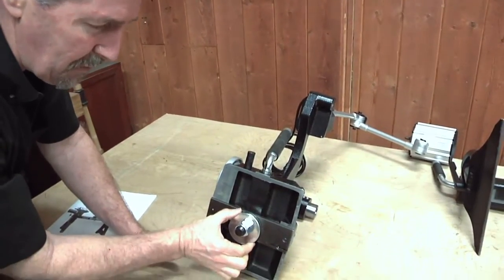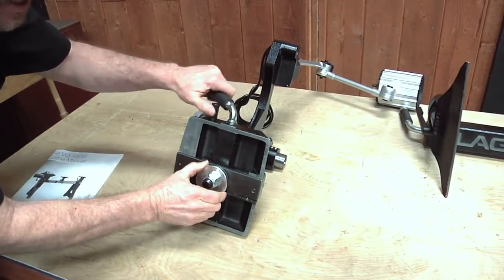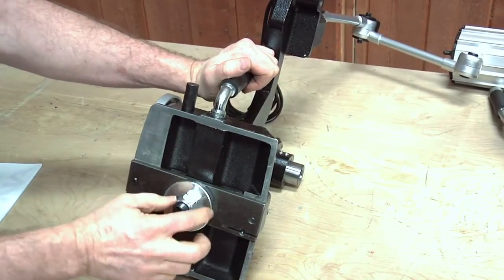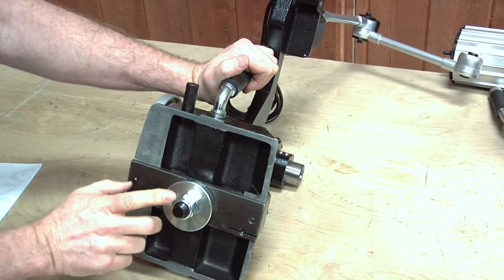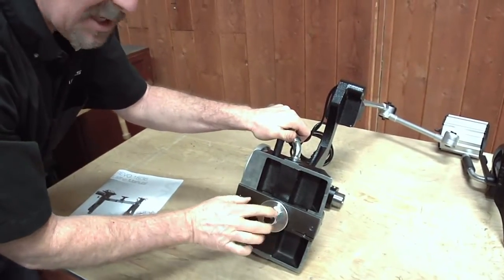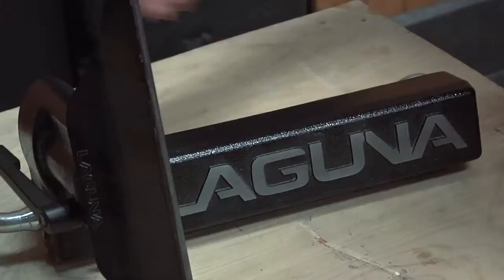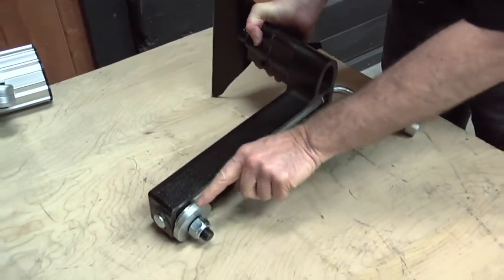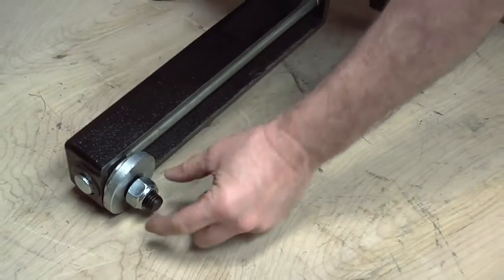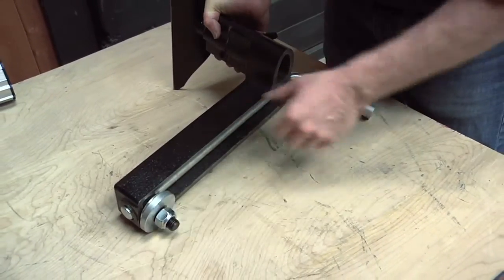There's also a large mounting plate on the bottom — when you use the lock handle on the tailstock, it tightens or loosens this to the bottom of the bed. If you have the tailstock locked and it still moves, you can take up a little tension by tightening the lock nut with a large wrench, just a little bit. It should be fairly well set from the factory, but you can tighten it there if needed. The banjo has the same sort of flange on the bottom; if it moves when locked, give the lock nut a small clockwise turn to increase the pressure on the underside of the bed.